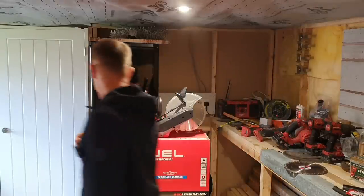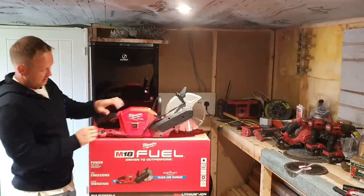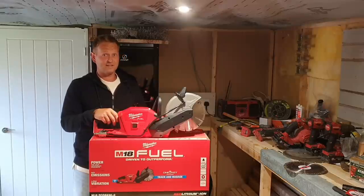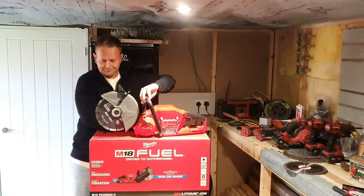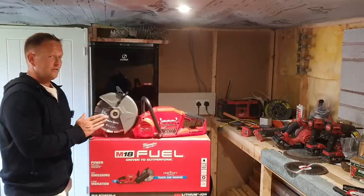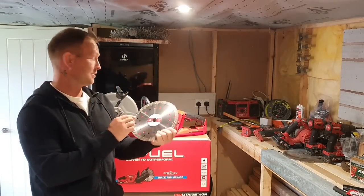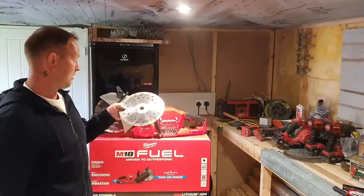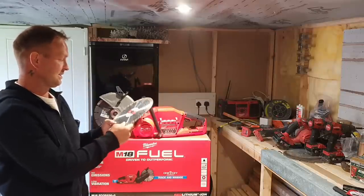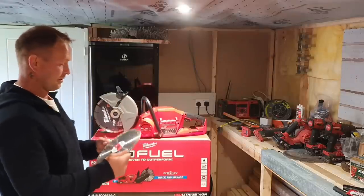It's got your water attachment that goes straight on the back — normal clip, open and close, standard. I didn't realise it came with a blade, but it does come with a Milwaukee disc. Check the bore size — if you're going to buy your own, the bore diameter you're after is 22.2mm. I actually went out and bought my own Marcrist disc, which was £45, not realising it came with one.